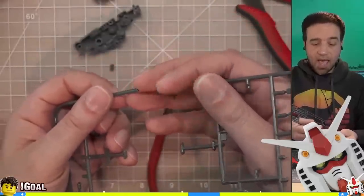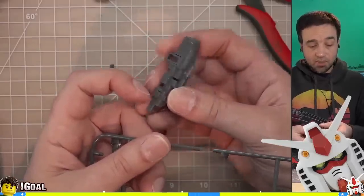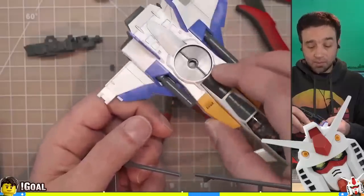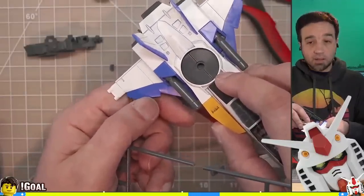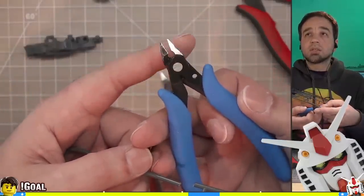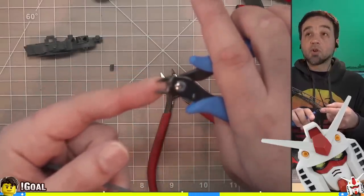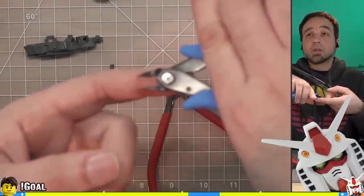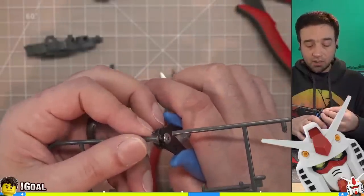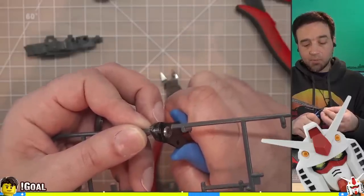If that break happens on a part, that leaves a big scar, and that scar can go deep into the plastic, especially if the plastic is colored like blue or red, some of the worst ones for that. You'll just have a white mark that goes way down in there. These are cheap, entry-level cutters, for hobby use, for plastics in particular, as opposed to wire cutters. They have a different angle on the blades, and these will cut farther in before they snap. So it's still cutting, and then it snapped right at the end.